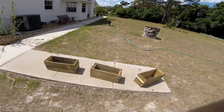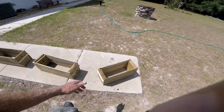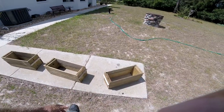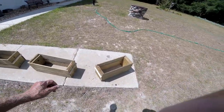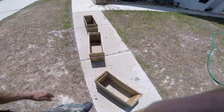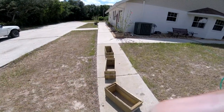And these handles I'm putting on here are just cutoffs from different projects that I'm doing. I just saved it, one by material, whatever. You can take some of this material here and even double it up. If you want, say, a 1-inch handle, just double up 2 of these pieces and slam them on the end with your brad nailer. Glue them on.